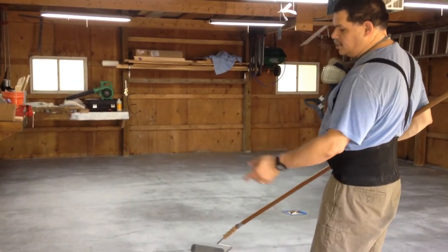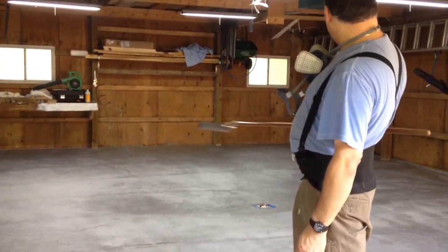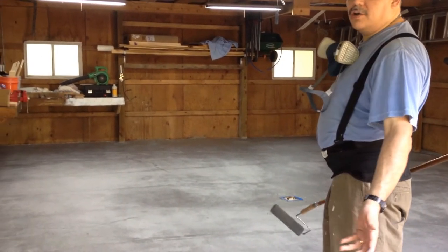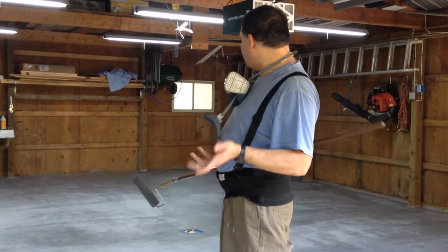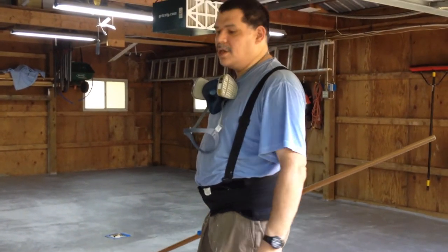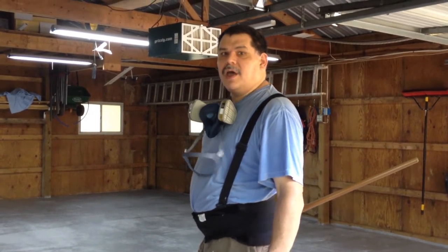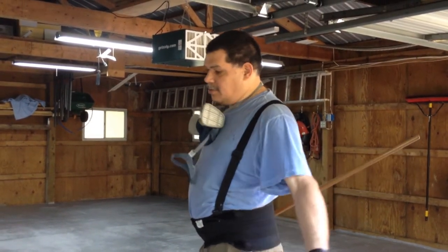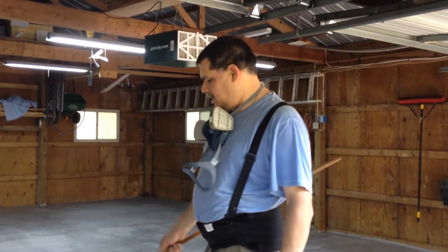It's a wet edge, which is why I'm rushing through this — you have to keep this edge somewhat wet. You can still see those lines, but it's still the first coat so I'm expecting a little bit of roller lines. I'm also expecting some blotchiness because the surface isn't consistent. We did etch it, power washed it, did a boatload of stuff, but I did not grind it anywhere. It's loaded with stains, rust marks, and paint marks.